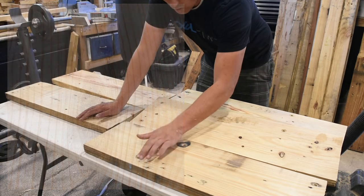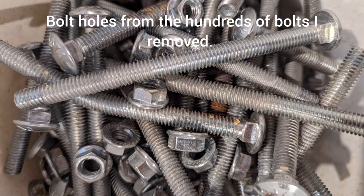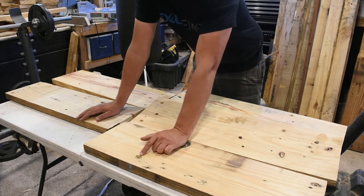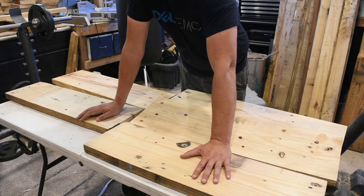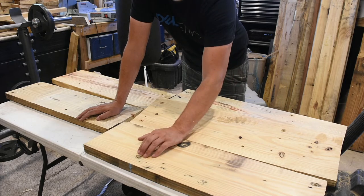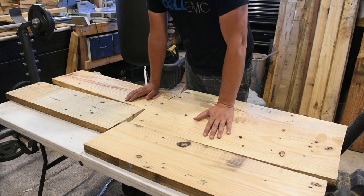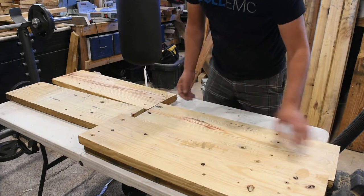I mean, obviously it's got holes in it, and I'm going to be filling these with wood glue and sawdust mixed together is the idea. On some of the bigger holes, I might put a dowel in there, glue it, cut it off, and then sand it off. Because it's going to have a subfloor underneath it, I don't need these to stop airflow, because it's going to be liquid nailed and screwed down to a subfloor. But I don't want these filling up with dirt and collecting dust and people getting slivers. So I will be filling all of these holes as well. But man, that planer is really awesome. That makes a big difference. So I'm excited to keep going. I have a couple hundred of these to go through. I'm gonna just keep going here and get a whole bunch of these done. Awesome.